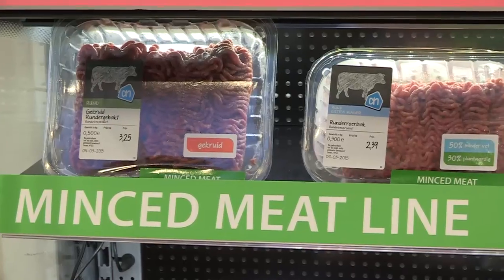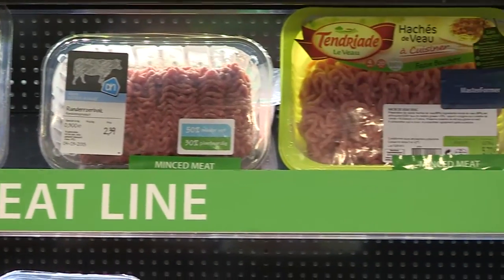The next step is that we are analyzing the fat content in the meat also, and this is a little bit unique, that we can measure the fat content with the X-ray, and we can do that in a very accurate way before we start processing the meat further down the line. What we see here is our online fat analyzer. It is using X-ray to inspect and measure the fat quality of the meat. This means that when we have all the meat up in the bin after the machine, then we know that we have a high quality product without bones before we ship it into our further processing.